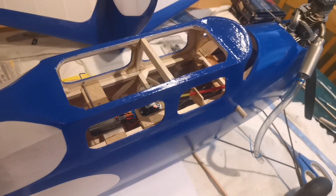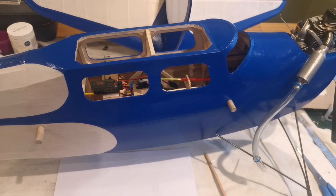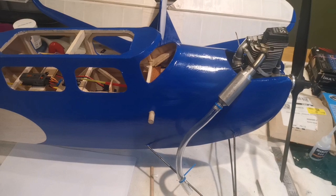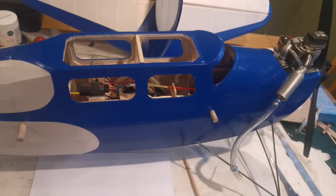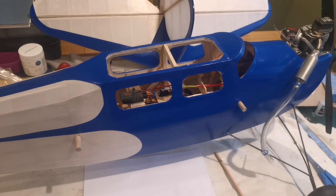It gives a really tough finish and totally dries within 24 hours. In fact, the amount of catalyst they tell you to add — if you add that, it goes off too quickly in my view. You can thin it down with cellulose thinners and you can spray it, although on this occasion I've simply brushed it on. I think for a vintage model like this, that's fine. But if you did want an absolute glass finish, you could achieve it with that product I'm sure.